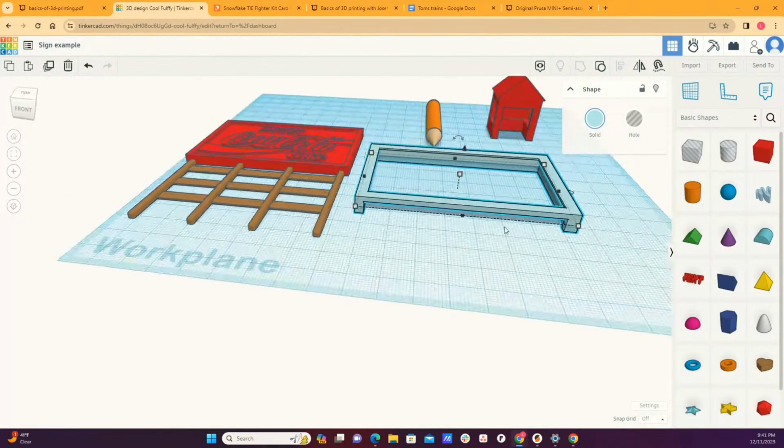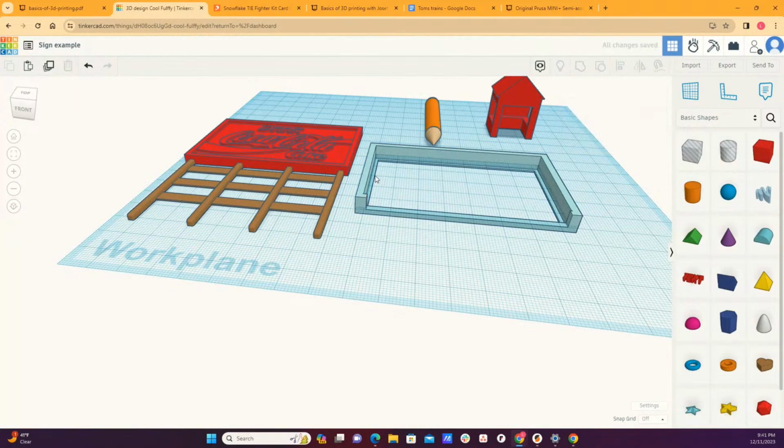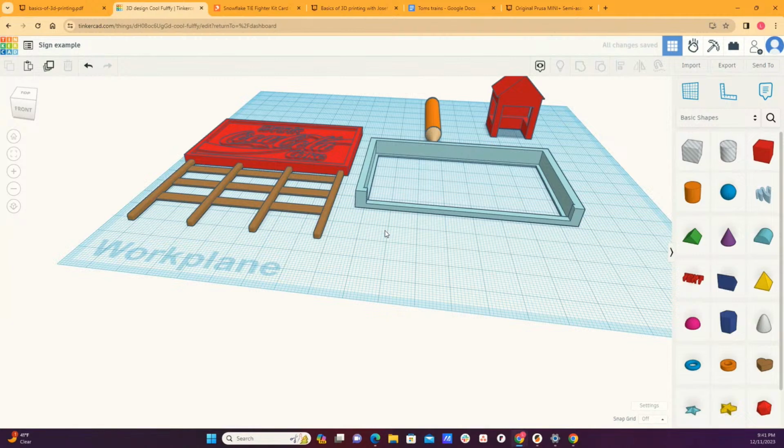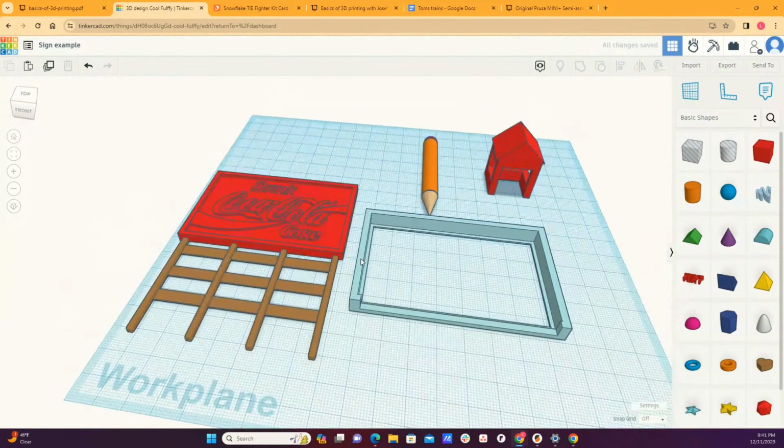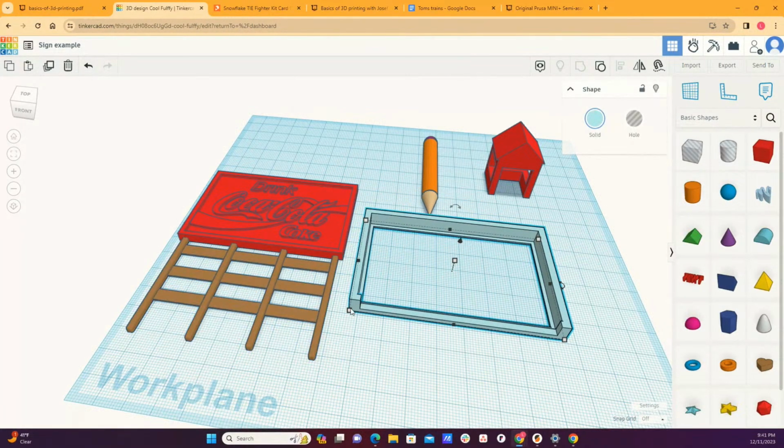It's not ideal. So you would just have to print it this way, even though you're going to use it the other way. But once I've created it, I have to know what it needs to be. So if I was doing this for real, I would take this at 75 millimeters, and I would probably make this one's inside diameter 75.4. So I have about 0.2 millimeters on each side of a gap. So I can glue it if I want to, but a lot of the time it'll press fit and almost friction fit if you have a 0.3 to 0.4 millimeter gap.